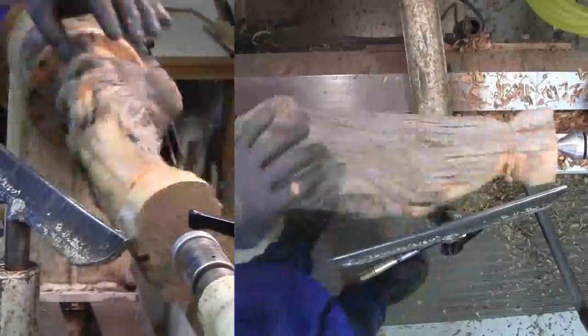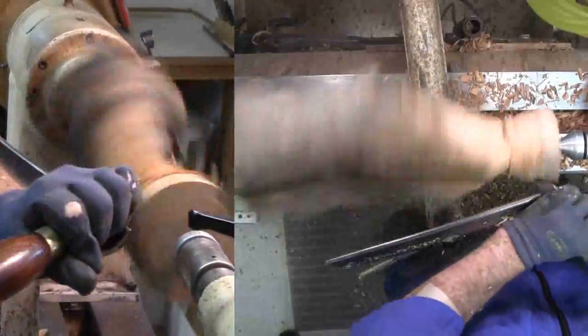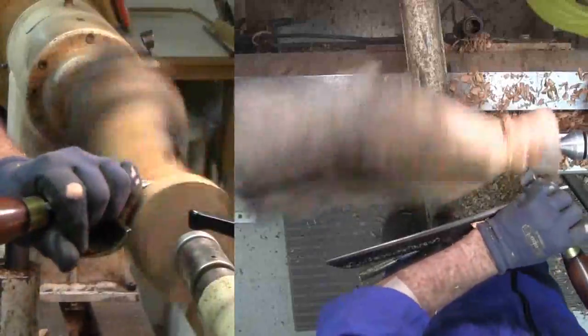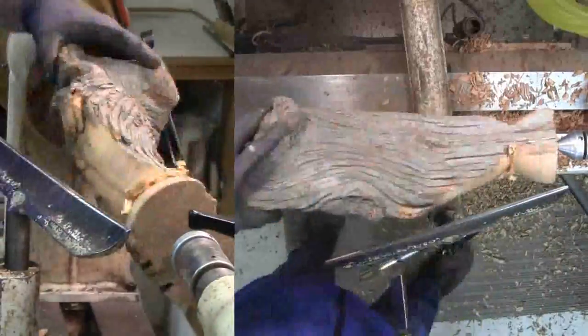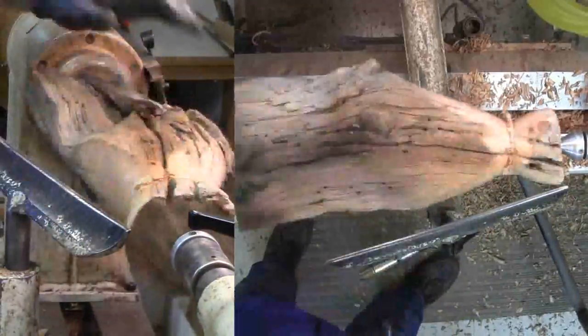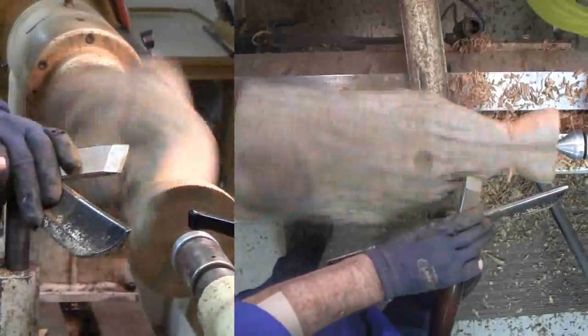There's not much of a bevel ride and he's cutting a lot of air. The ghost image at the top of the spinning wood is all he has to go by. The neck is almost a large, nasty cove. How much to turn is a balance between preserving the weathered surface and obtaining a clean flowing shape.